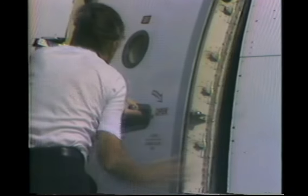To open either of the two forward cabin doors from the outside, pull out on the handle as far as it will go, rotate the handle 180 degrees, and then pull the door outward to the open position. When the door is fully open, a gust lock will hold the door securely open as a protection from wind gusts.